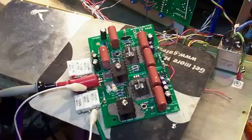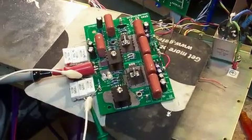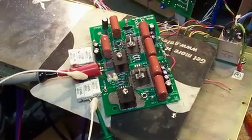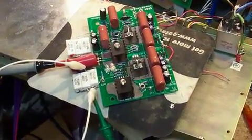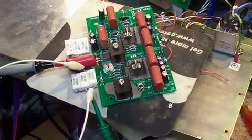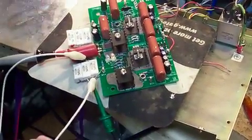Pow. Okay, now down to 1.1 volts into the clip lead. It has shut itself down. Down to 0.5. The clip lead is not getting extraordinarily warm. 0.4. Okay, it has shut itself down. 0.3. The other supply is not being shorted.